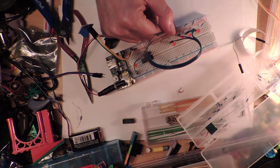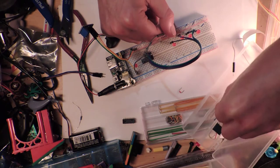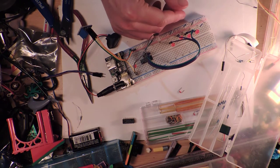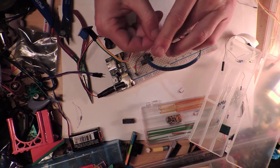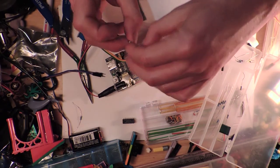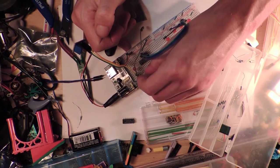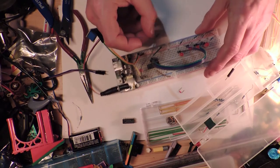And yet again, I feel like I could have a higher thing. I really should have had more. You know what I am going to use? I do have, within arm's reach, my favorite 5.6 kilo-ohms with a little bit of sticky stuff on the end so they don't work so well, just to help increase the resistance. So I don't want this LED to be very bright. I don't care. It's just got to tell me whether or not it's flashing.